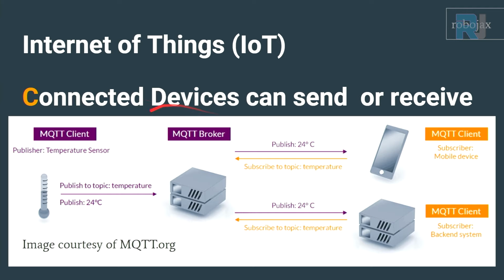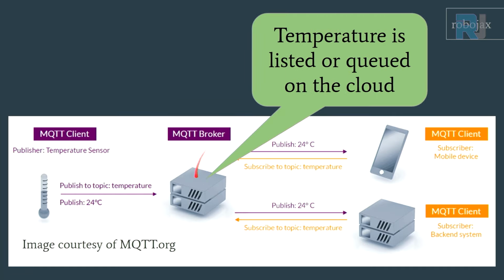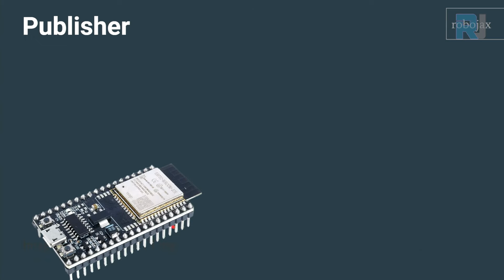Now, this is the Internet of Things from MQTT.org, and we have a client, a broker, and another client, which is the subscriber. In this case, we have a temperature sensor that sends information to the broker, and the temperature is listed or queued on the cloud, and our subscriber can read or fetch a particular topic, in this case, temperature. The topic is temperature, and we read that temperature.